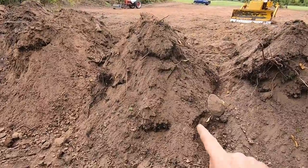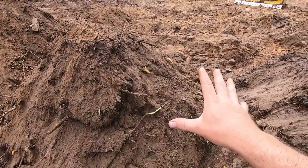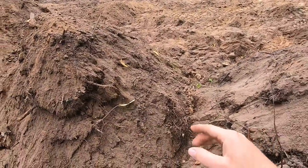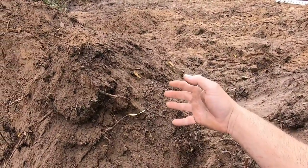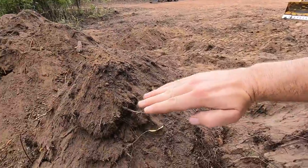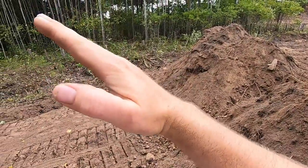So now let's come into this pile, see if we can push it out the other side. And I'm probably not going to be able to talk. I'll try, but in case you can't hear me, another characteristic of these D2s, when I get that blade with a bunch of material in front of it and it suddenly loads the drive line, the front end of that machine is going to want to pitch up, and that's going to want to in turn raise the blade.